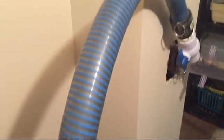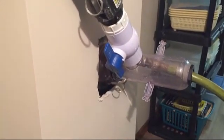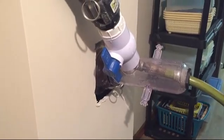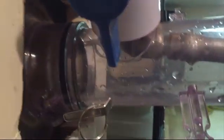We do this so we don't have to carry the water out. We have our two-inch return hose on there, and we leave our jetter in there to create a seal for the backside. We'll return this water without pumping the scale back — we stay at the bottom of the can. We've got no leaks, and we just have a regular sump pump on there.